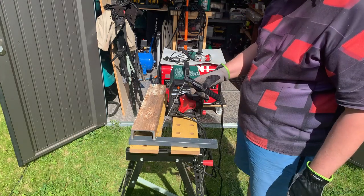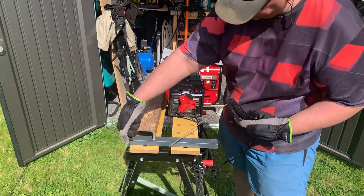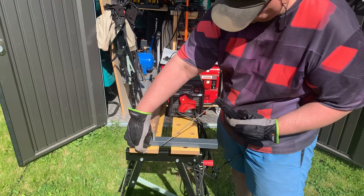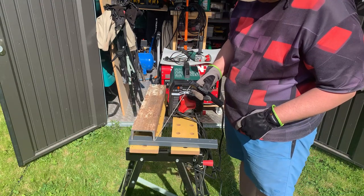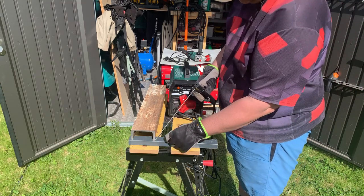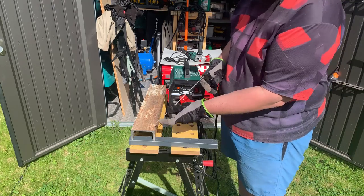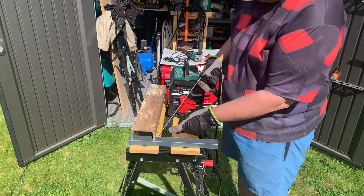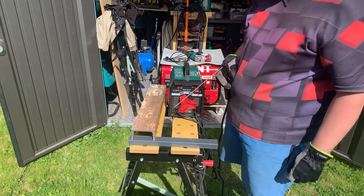When I try to strike an arc, the current will go through the metal all the way back to the ground. If this area is clean, there will be enough conductivity. The hope is that the current-generated arc will actually jump to both materials, combine them, and fuse in the added metal from the electrode — and then you can just weld it without any issues.